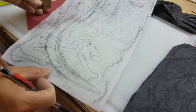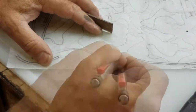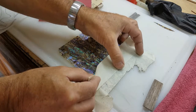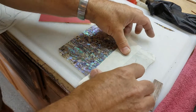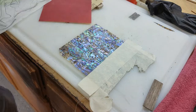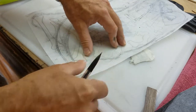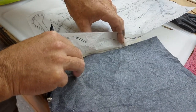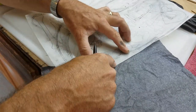When I'm done I freehand smooth this into a line which is parallel with my original line. Now get that masking tape and very carefully stick a length of it across the width of your veneer. Be careful — once it's stuck down you're not going to be able to get it off without damaging the veneer, so no bends or wrinkles. Line up your artwork on the tracing paper over the veneer so that you're using the veneer very efficiently — it's quite expensive so you don't want to be wasting it. When you're positioned, slide in the carbon paper and trace the outline.